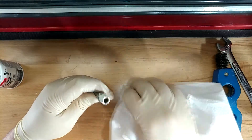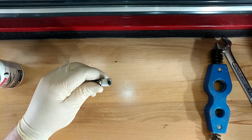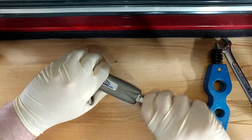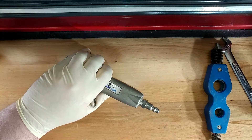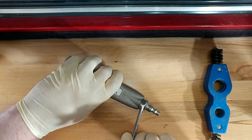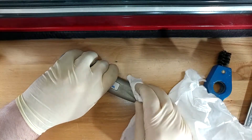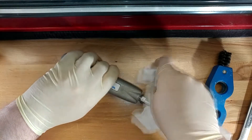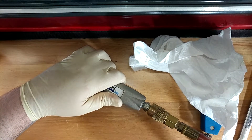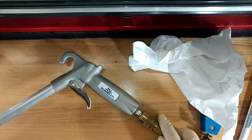I'm sure I've just painted the whole end of it over again. All right, I think we're good to reinstall now. Let's get her threaded in. I wonder if I took it easy on the tape on this because I had already cracked that other fitting by the time I did this, and this gun was kind of expensive so I was just being a wuss. But I certainly don't want to break this gun. That feels plenty tight. As you saw, I wasn't reefing on it, and you also saw we've got plenty of thread sealer in it now. Let's see if she continues to leak. I don't believe so. She is all good — perfect.